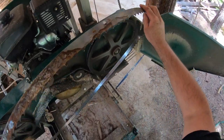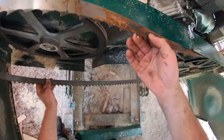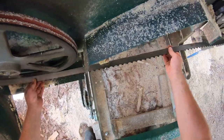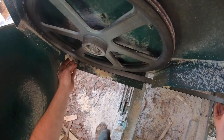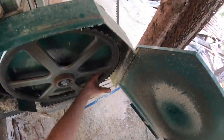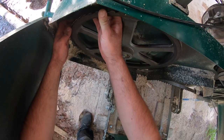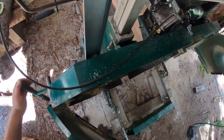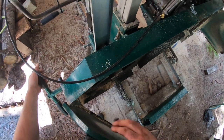If that bothers you, get a steel brush out here — maybe you could keep one at your sawmill and get it cleaned off. I just don't happen to have one here. Gloves would be an ideal piece of equipment right now. I'm just getting it so the back of the blade is flush with the back of the band wheel. With a new blade you usually have to adjust the alignment slightly, but we'll start it off in the right spot. Once it's approximately where it needs to be, I'm bringing the tension on — you can watch the bandsaw wheel start to tilt, see it moving.